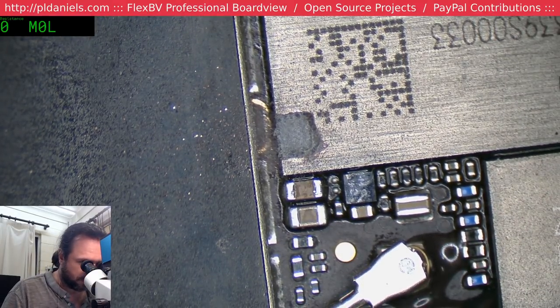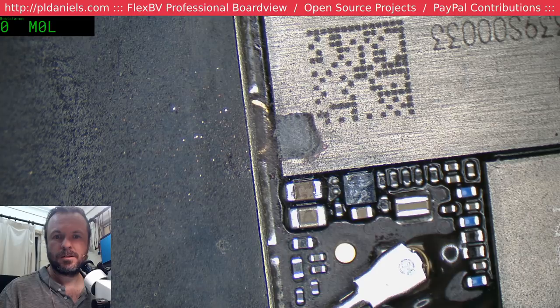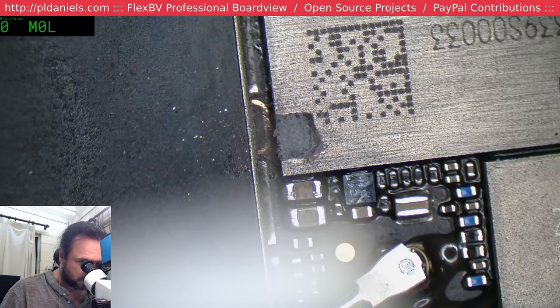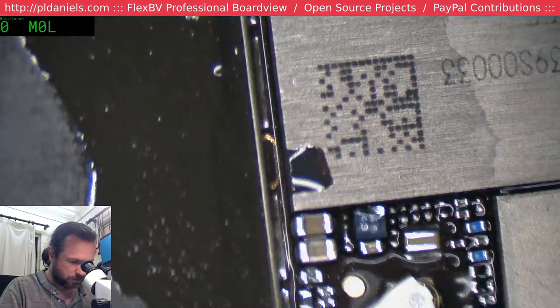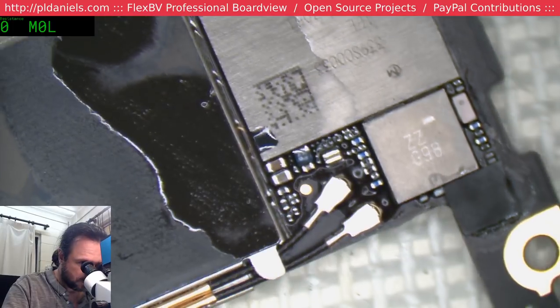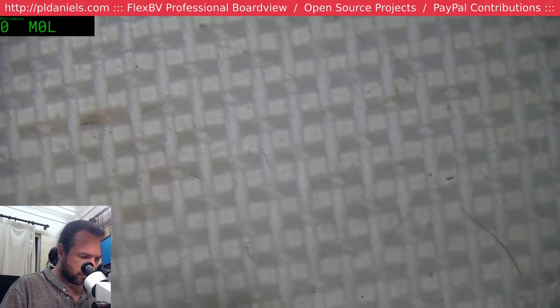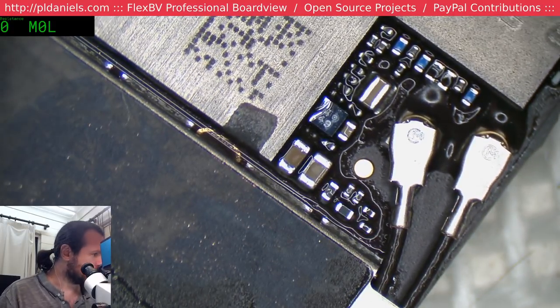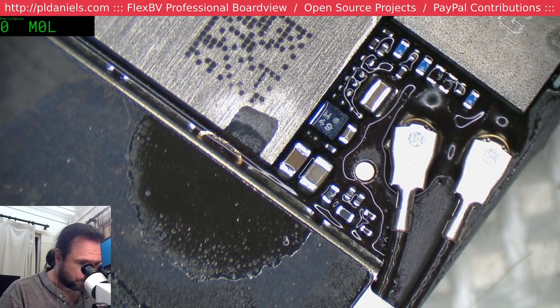Now the worst thing about this is that for me to test this every time, I have to take it out of the holder and apply the power. When I figured out this short, I put power in on the cap line short and next to the LDO, and it was hot, which led me to an FL filter on down the line. Sounds like Jason got more serious than I did. Okay, I just want to see that I'm in the right vicinity to start with. Yep, pretty much right on the mark.